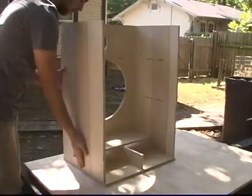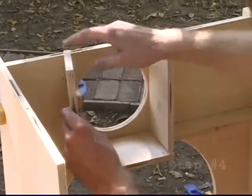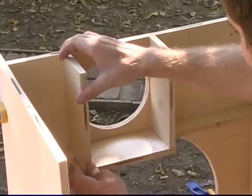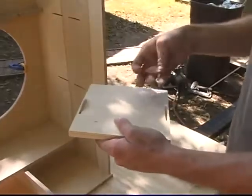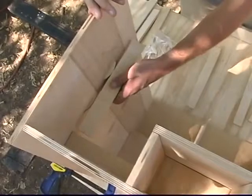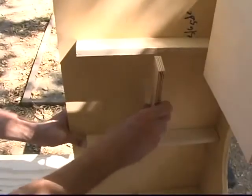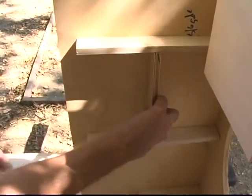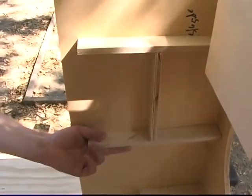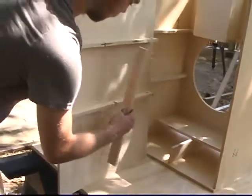Install the other side. Step four: install the bracing. The side braces also install with biscuits. The pillars do not have biscuits because they may require a slight trim to fit, as the side braces might also. They are about 1/16th under the specified size to ease construction — PL will fill the gap. After you install it, the back of the chamber installs with biscuits and braces. Install the back and its braces, reaching through the baffle to install the braces and through the open top.